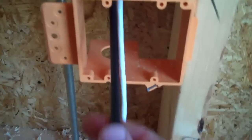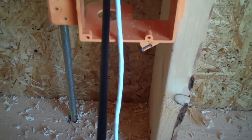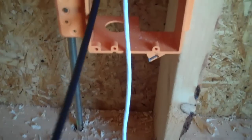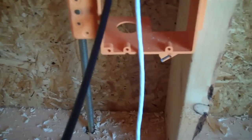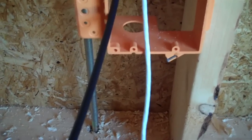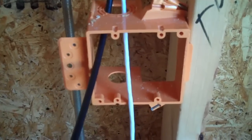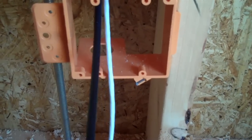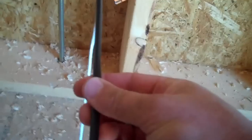In this box we have an RG6. You can use RG6 or you can use RG6 quad shield. RG6 usually works perfectly fine. An RG6 quad shield just has more shielding to help keep noise from inducing onto the line, but we always use just regular RG6. Unless there's some reason to use RG6 quad shield, RG6 works just fine.